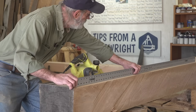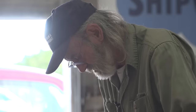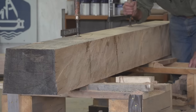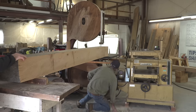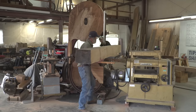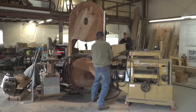It's got one little spot right on the end here to go yet, so I'll take care of that. That's how I know where the high spots are - I take my little planer and knock those right down. I've got it set to just barely thousandths of an inch, so it really works like a hand plane but obviously much easier. We're going to flip the horn timber over now, and that's the way it's going to go through the saw. We've got it on dollies, and we're going to wheel it over and line it up with the bandsaw, but we have to lift it up quite a bit higher. I'm just going to go over this cut with Halsey so we're on the same page - he's going to do the pushing and I'm going to do the steering.